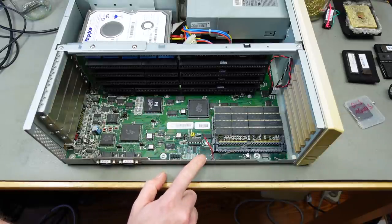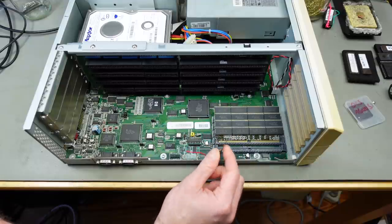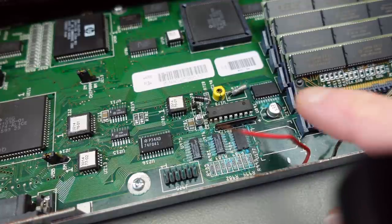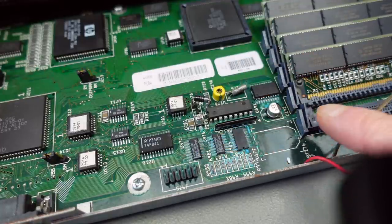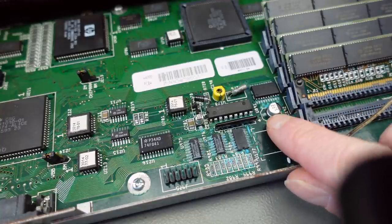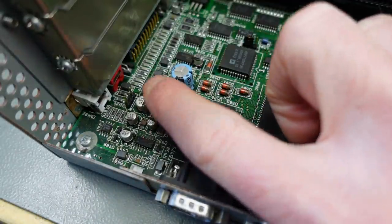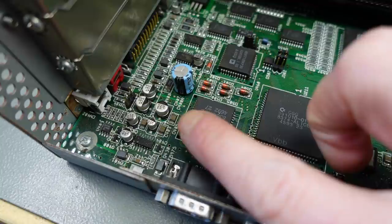This is where the battery originally sits. Seems somebody had a replacement battery in there. There's wires coming from here, presumably. I see some dull pads everywhere. So I think the battery leakage actually mostly is here. There are some leaky capacitors on here. You can see the dull pads on this one. And yeah, basically in this whole area, you can see very dull pads on these surface mount electrolytic capacitors and also on the other components surrounding them.